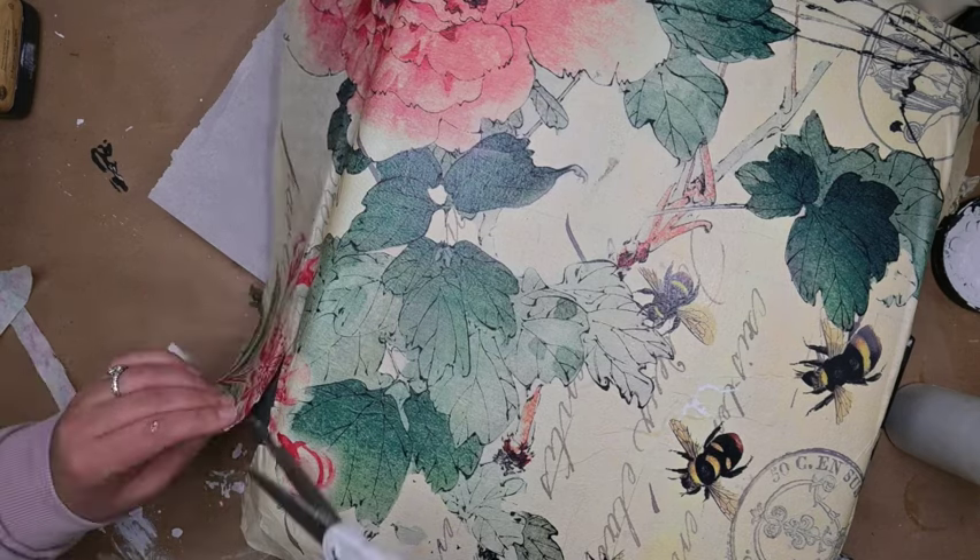There's no rhyme or reason to how we put this on — this is meant to be fun, don't think too much about it. Just dab it on however you want to. I'm doing it in a stippling motion because I want to get some peaks with that paint, so that as we go over it with our top coat and then sand back, some of this color pops through. If you get a rusty box like this, your rust is going to pop back through too. If you don't want that, I highly suggest giving it two good coats of the brand new Dixie Belle Bonding Boss to help prevent that rust from coming through.